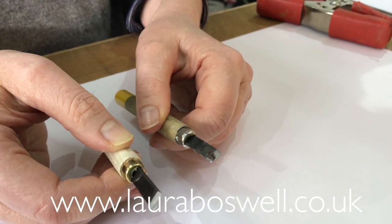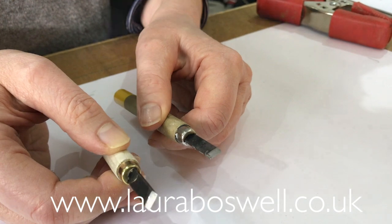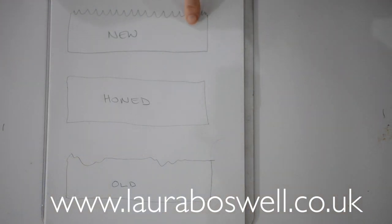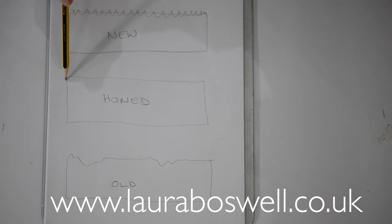Let me explain why the new one looks like satin and why you need to polish it before you use it. When you buy a new blade or cutting tool it will look like satin because it's been sharpened — it'll be razor sharp, but there'll be lots of little micro ridges in the blade. You'll start cutting and it'll go blunt quite quickly, because as you cut you knock all those little ridges off. By polishing it you take away all those little ridges and the tool becomes completely smooth, so it stays sharp for longer.